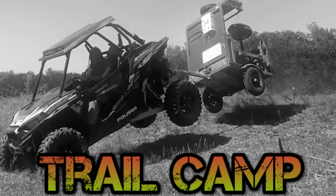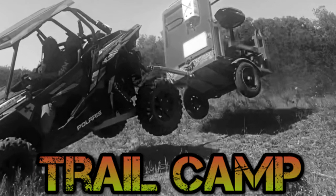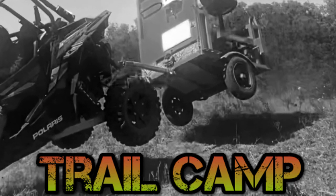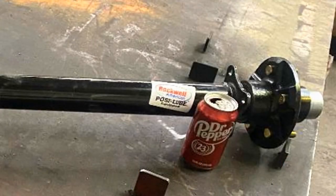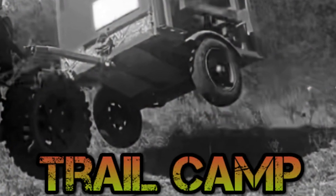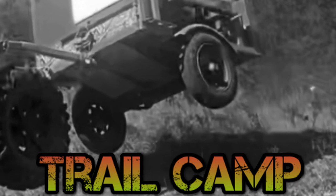This is a really good angle for us to start looking at this trailer because when we design a trailer, we're going to design it from the bottom to the top. In this particular case, we're sticking with the 3,500 pound axles that are specially made for us by Rockwell American. They're 48 inches long, they have 3 inch press bearings in them, and it's a 3 inch casing at 3 sixteenths thickness. We have put over 900 of these axles out on the road without one problem — so why would we want to change it now? We wouldn't.